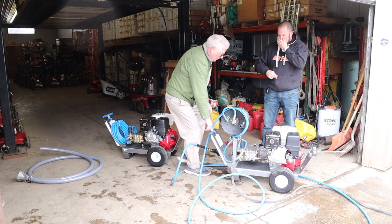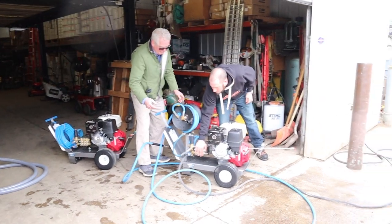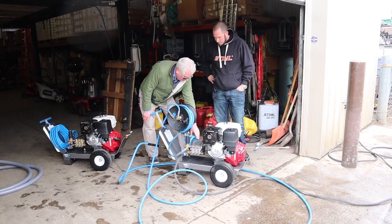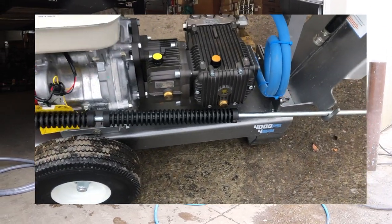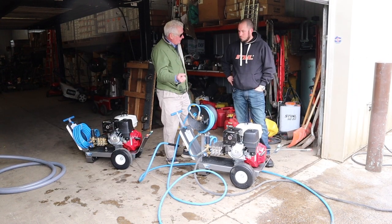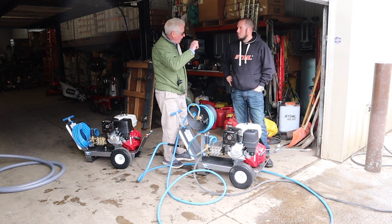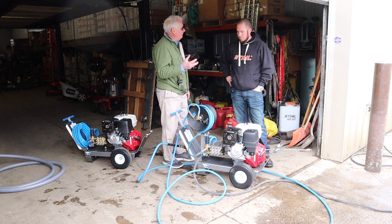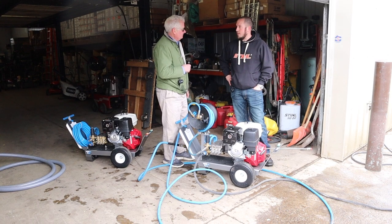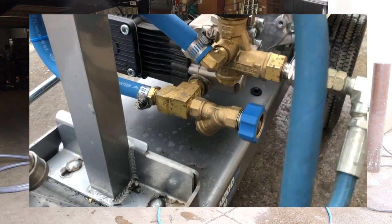If you want to put your hand on this pump — we've been running it for 15 to 20 minutes with the gun off. It has a three-foot half-inch radiator hose that cools the pump when your gun's off. So when you're on the phone or drinking a cup of coffee, it's keeping that pump a lot cooler. Normally you have only an inch of water, and when the machine's running at 3,400 RPM without using the gun, it's like running an engine with no oil — you burn up a pump very fast.